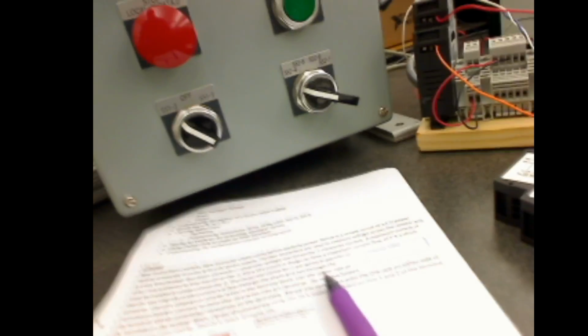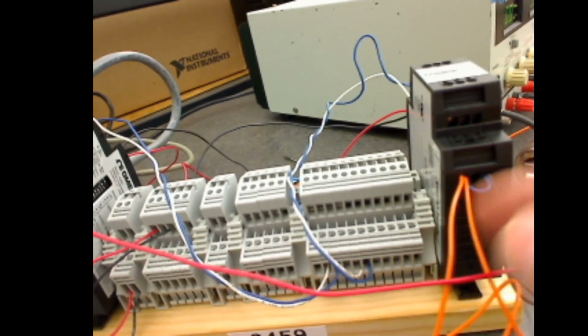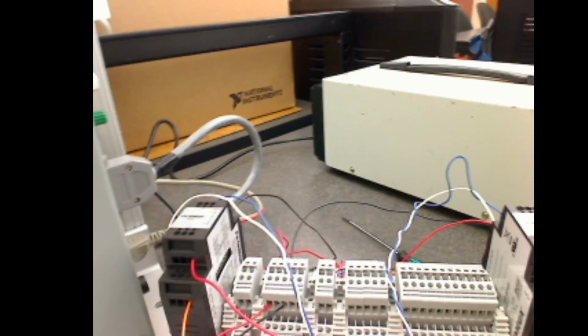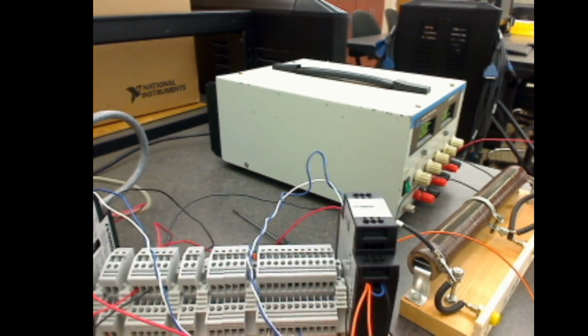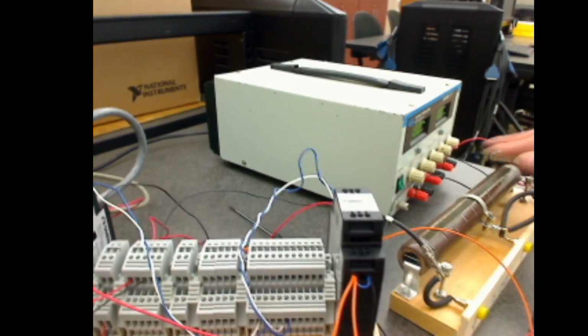So having a shorter shunt, which is what I did, I sort of measured it off, but not real accurately. I just made it a little bit short, and it's a little bit off. But here is my shunt wired in to the positive side. I'm using the orange, which is this intermediate connection here. And I have my power, the red, if we can see that way over here, the positive voltage on this side of the resistor.